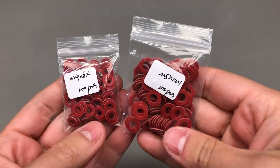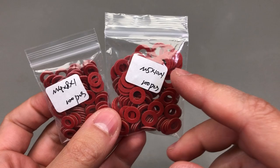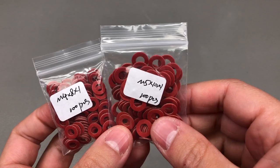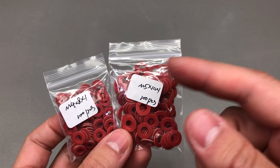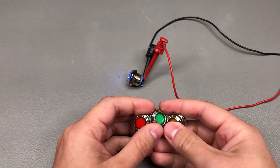Next up I got a couple more different sizes of paper insulating washers. I like them; they're super cheap and I just want to keep different sizes available in a kit. I mainly use these between screws and PCB surface when there isn't a keep-out area defined on the PCB design itself, just to prevent the screw from scratching away the solder mask finish and possibly damaging tracks or causing a short circuit.